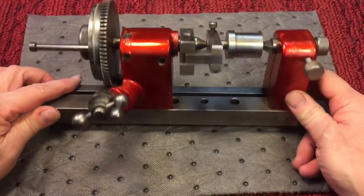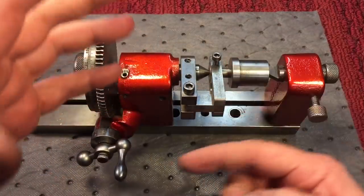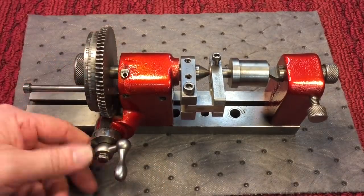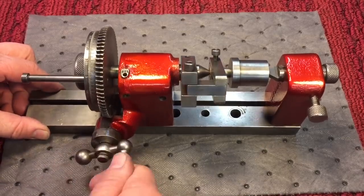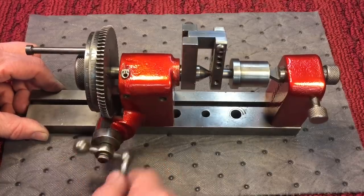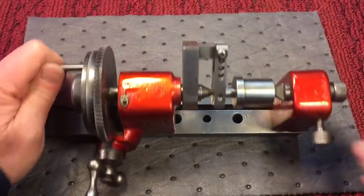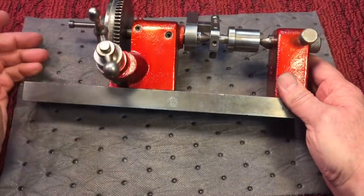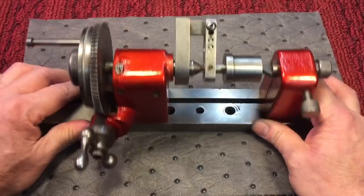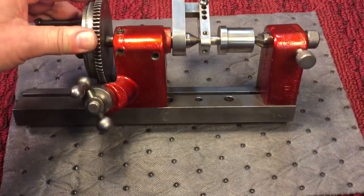What we have here is an antique South Bend milling attachment that would go on your lathe — it was an indexer. What that means is, let's say you wanted to drill a certain number of holes around an item. You would attach this to your machine, whether a lathe or a mill, and by using this incremented dial here, you can spin it a certain amount and break it down to get as many holes as you want. Let's say you want a hole every 10 degrees, or you want 20 holes — you can evenly space them just by spinning this and then drilling or machining whatever you want. This thing looked like it came out of the sea when I got it, it was all rusty. I did this maybe 15 years ago with that candy apple metal cast paint — held up really good. Great paint, you can do different machines and things like that.